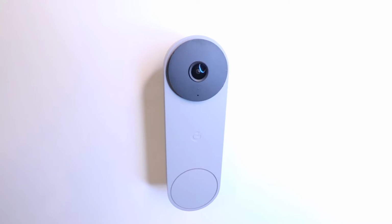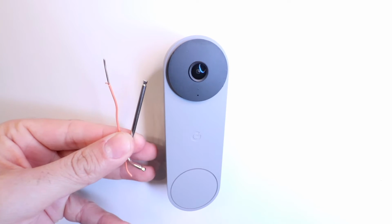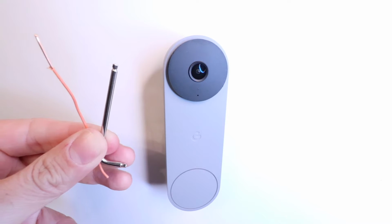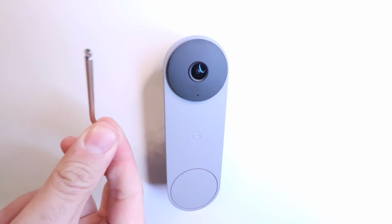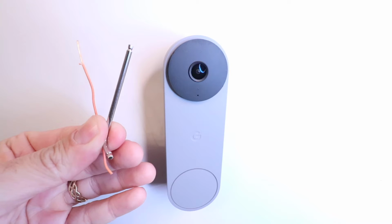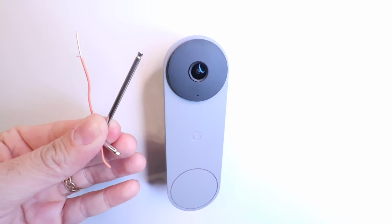Now, in order to reset the Nest Doorbell Wired, which was launched in 2022, you're going to need two things. You need either a paper clip or piece of small wire, and you need a 2.5 millimeter Allen wrench. This Allen wrench actually came with the Nest Doorbell, but if you don't have that or you lost it, we're going to include a link below to a 2.5 millimeter Allen wrench you can pick up on Amazon, or you could just go to your big box store and pick one of these up.